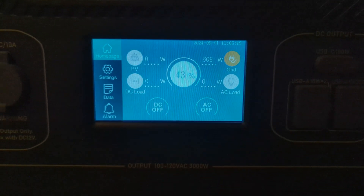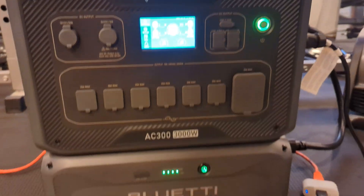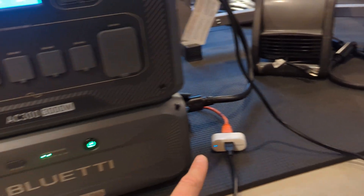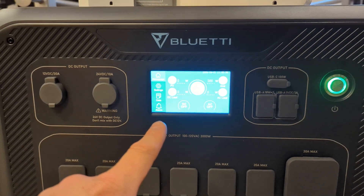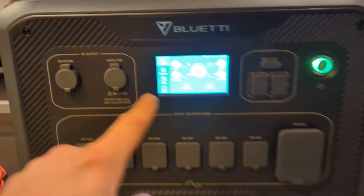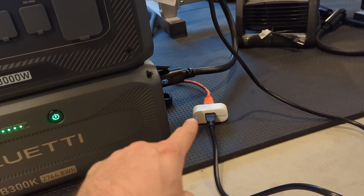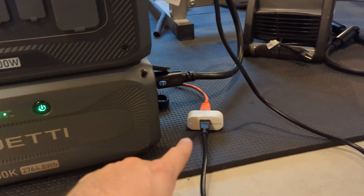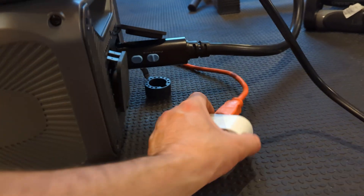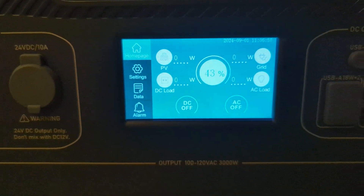It's important how you configure your Bluetti for this to automatically work. I'm going to go over the next steps on how to configure your Emporia and the settings in your Bluetti so that when this Emporia turns off — because let's say I set a schedule that says every week for 15 minutes, turn on and send power to this unit — once the schedule shuts this off, the Bluetti will lose grid. My unit's still on, but obviously there's no grid and nothing coming in.